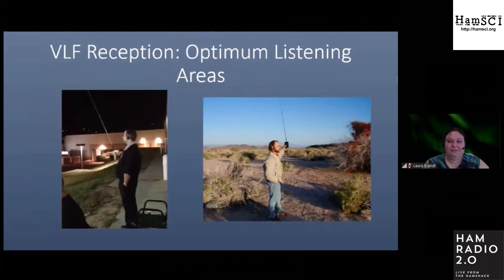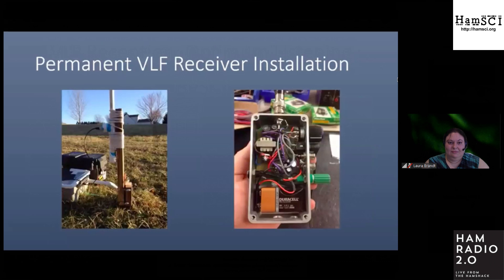VLF enthusiasts have been using VLF receivers for many years to listen to and record natural radio events. Power line interference has always been the enemy to VLF natural radio, so listeners would often have to venture out in remote areas, tens of miles away from power lines, to capture natural radio events. Automatic capture of VLF events is now possible using a PC with a sound card as a VLF SDR, using open source software called VLFRX Tools, written by VLF enthusiast Paul Nicholson. The software records the VLF signal, GPS timestamps it, filters out the 50 or 60 Hz mains hum with a tracking notch filter, detects whistler and chorus events, as well as sudden ionospheric disturbances through VLF transmitters.